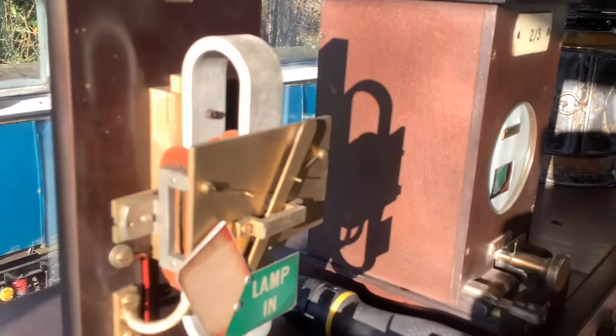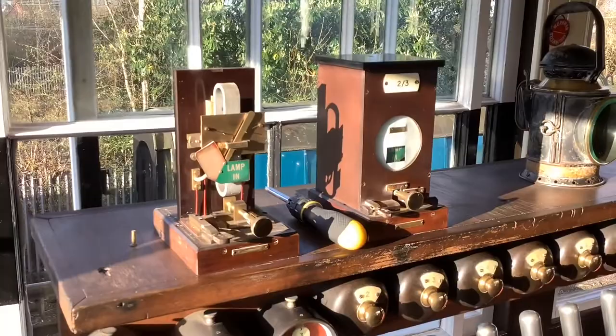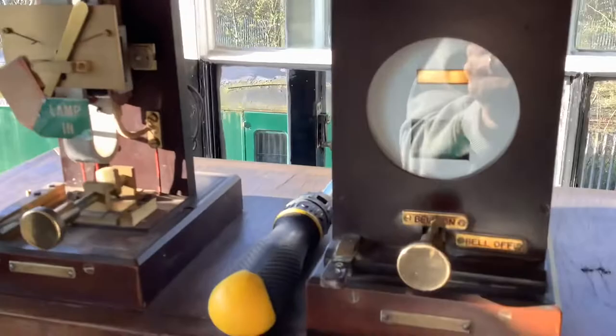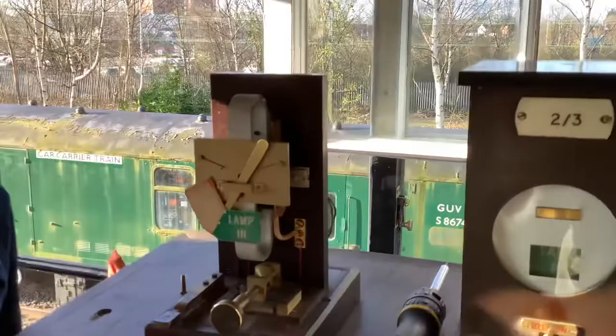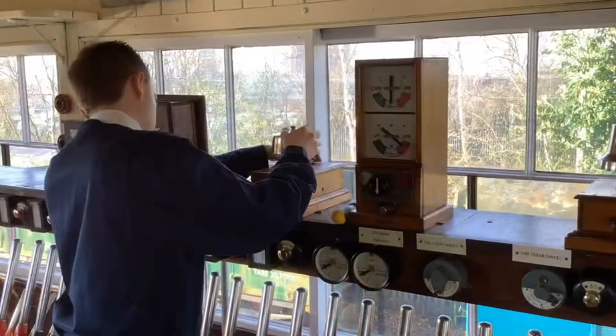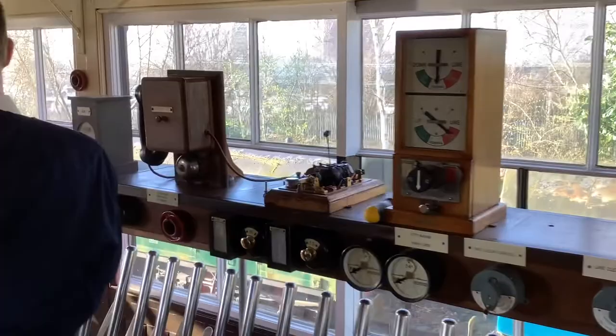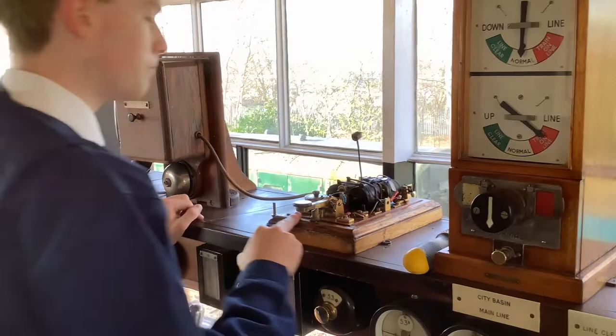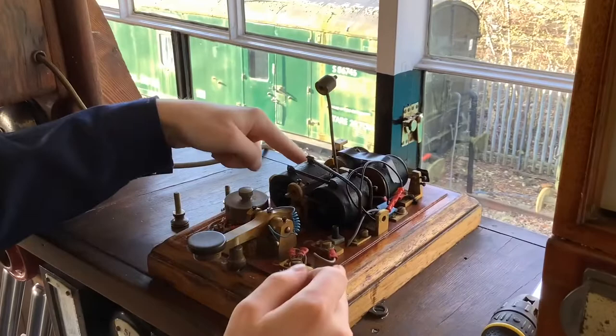Everything western in my mind is beautifully ergonomical — not as ergonomical as the midland frames, those REC frames are fantastic — but all the instruments I just love because if you've got the cover off you've got to have it in their own position, so that's handy. This was made — it's normally stamped at the top — mainly by Walters or Thomson's. Here we've got it right behind the shelf: this is a Thomson bell. You've got the bell tapper, the earth connection, your main power connection and your line connection — Z, E, L and C.